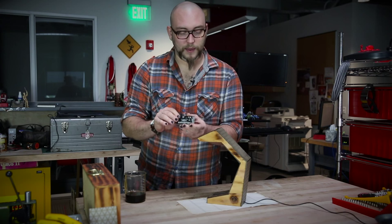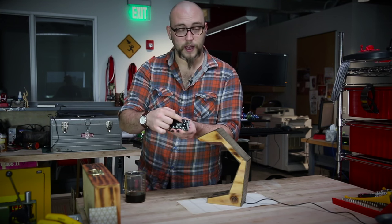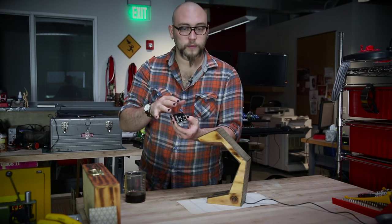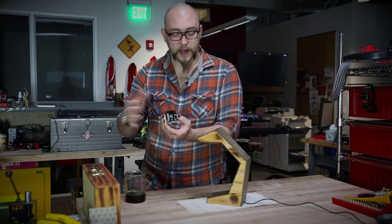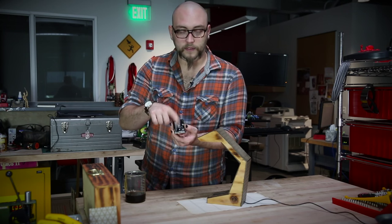The other nice thing about this board is that because it's controlled with a microcontroller and has a separate digital potentiometer, it can not only emulate a regular mechanical pot, but it can also output PWM signals and serial communication.